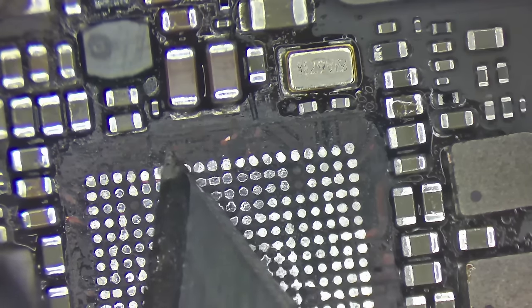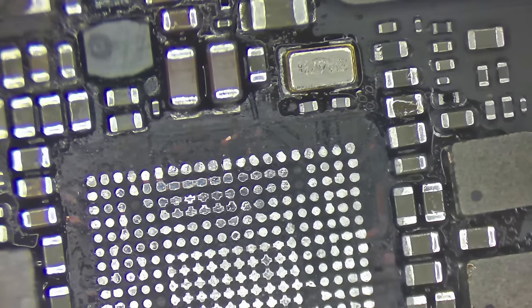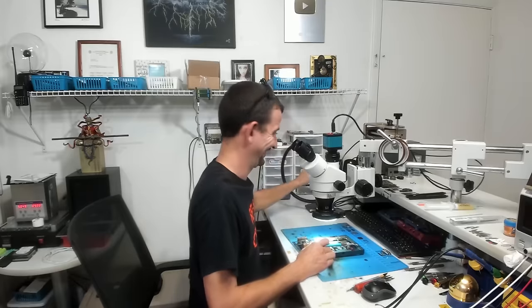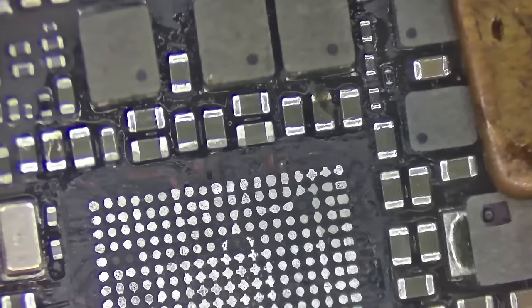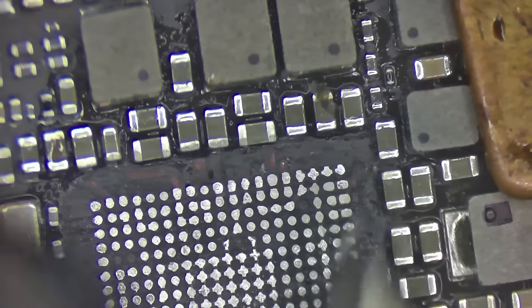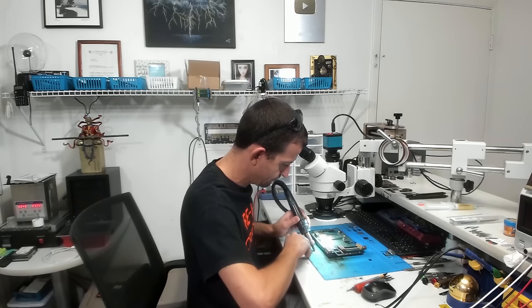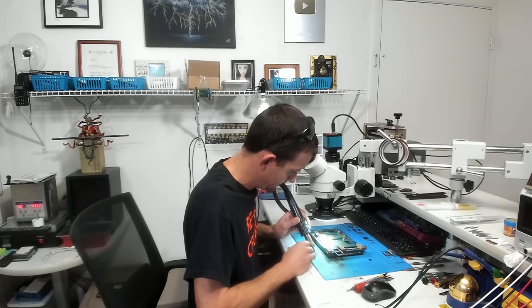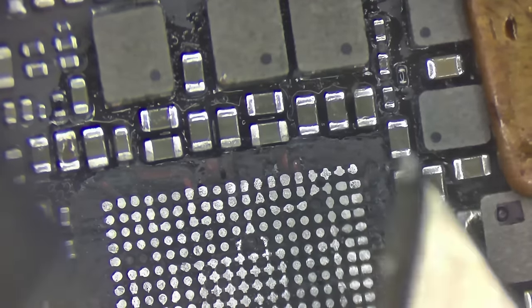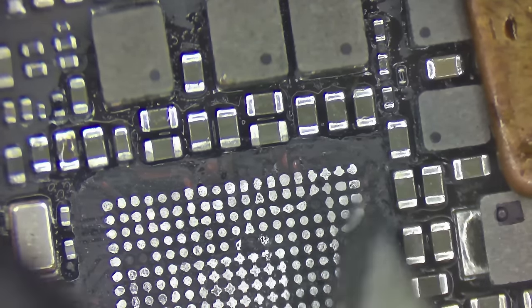Yeah, we can't nitpick too much here. I don't want to pop vital pads off. I just want to make sure it's squeaky, spotless, clean. But I don't want to nitpick. And then now I'm actually going to go after these two high solder balls here. There's a couple of pads here that have solder on them that needs to go. And rather than getting out wick, again, I'm just going to take the tool that's already in my hand and shave those off.